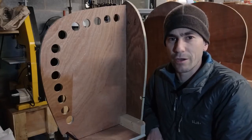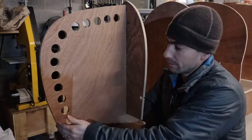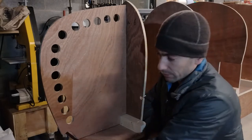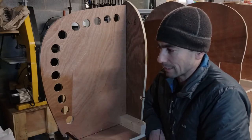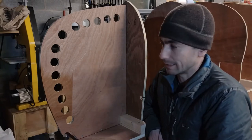The stems are laminated at the bow and stern of the boat around the stem moulds. They're in two pieces. The inner stem is directly against the mould and the planks land on the outside of it. Once planking of the hull is complete the outer stem is then fastened to the outside. The outer stem in particular takes some abuse when the canoe is in use, so it tends to be made out of a harder wood. Ash is a very tough, very strong wood and ideal for this use.